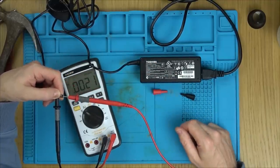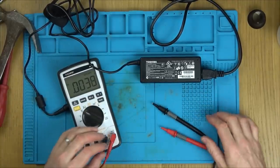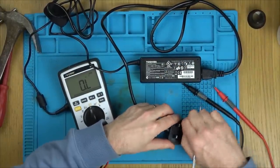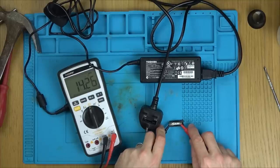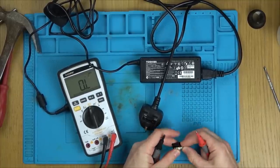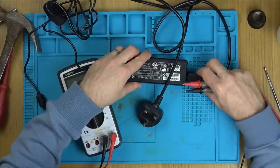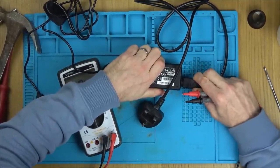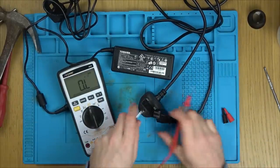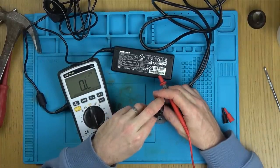There's nothing happening at all — it's plugged in at the moment. I've checked to see if the fuse is okay, and the fuse is okay — I'll show you that now purely for the purpose of the video. We've got continuity through the fuse. It's a 5-amp fuse, which sounds about right. I'm going to check this side of it using continuity so I don't have to worry about having it plugged in. The earth is the top one and that's okay.